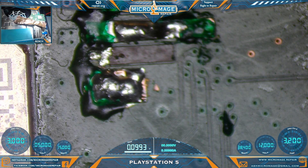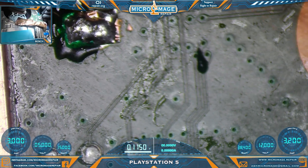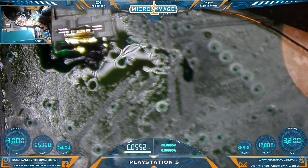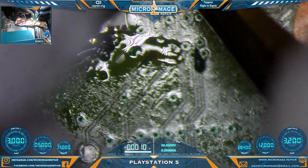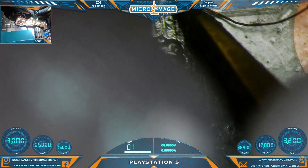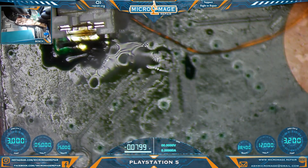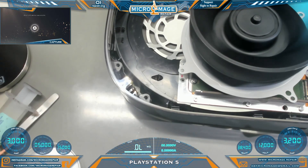I don't like these mysteries. Solid - grab another connector. We'll go one wrap for now, leave the extra wire on there. One wrap and get it off if we need to. Just solid enough to test I think, so we'll touch everything up if it works. And as you can see we have fan spin - the unit is powering back on, it's working! We did apparently have a connection problem on the gray signal line. So future reference: we will not run a copper pad there, we will run a jumper. Good to make a note of that.